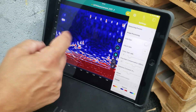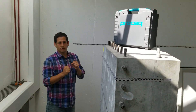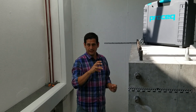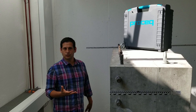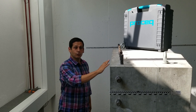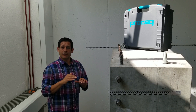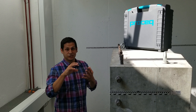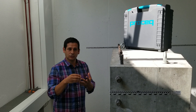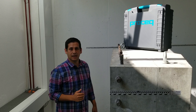This is important because we talk a lot about conductivity as being a struggle for GPR. When soil or material is conductive, it eats away at the electrical field of the EM wave signal. But people also have to take into account reflection events. Every time the wave reflects off of some sort of contrast, it eats away at your signal. Going through the rebar on top makes it difficult to see the back wall, but going through no rebar on the bottom, the clarity was exceptional. There are multiple things that can attenuate your signal: conductivity is one, scatter from small inconsistencies is another, and reflections will also attenuate your signal. If you have layers, a lot of times those lower layers will seem as a smaller response, because the signal has reflected so many times before it even got to that depth.